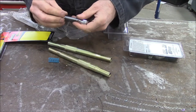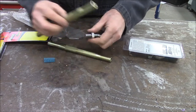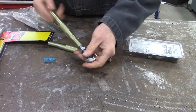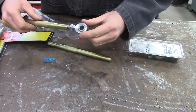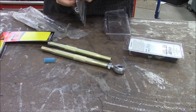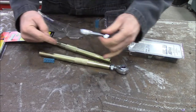This is a reverse thread nut. Some manufacturers put notches on the threads so you know it's a reverse thread — not so on this one apparently. They thread these in opposite threads so that you can just loosen the lock nut and turn the tube and it would get longer and shorter.